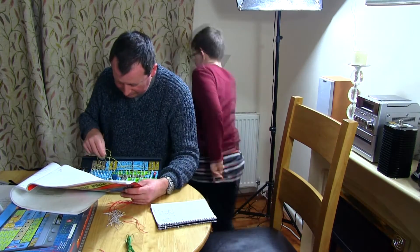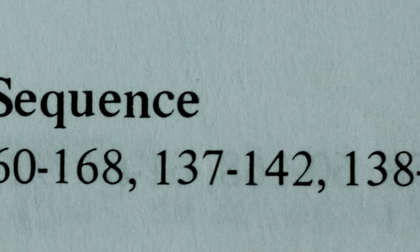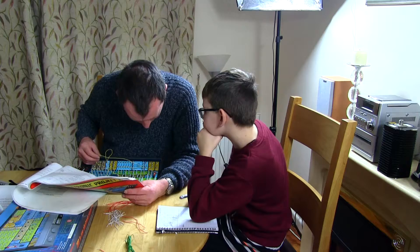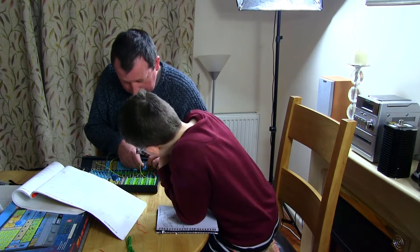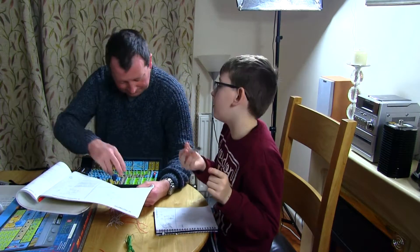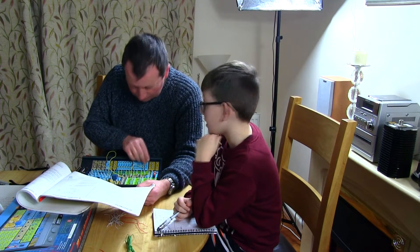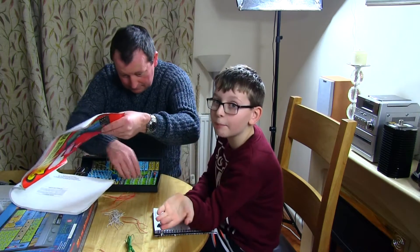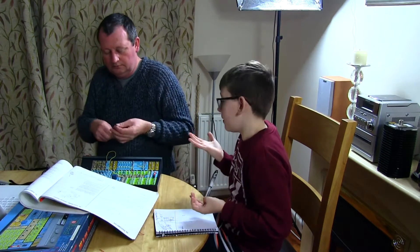60 and 68 all come from the battery terminals going to 168. Then 137 to 142 - I can already see there are wires missing. 137 should be going to 142 - that looks wrong. See, this is where you've got to be very careful. I got it wrong - this is an example of what can happen. 138 also has one wire missing to 171. If you make a mistake, get your dad or mum to check it.